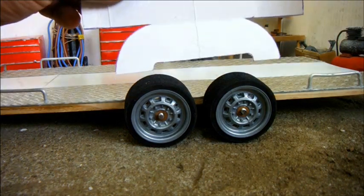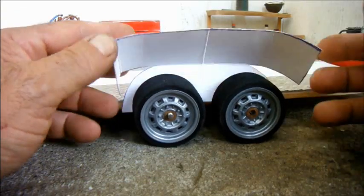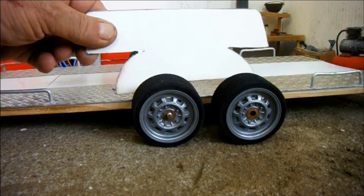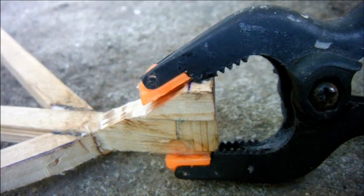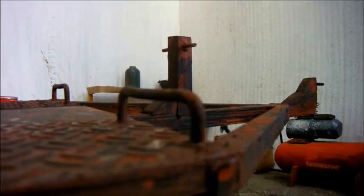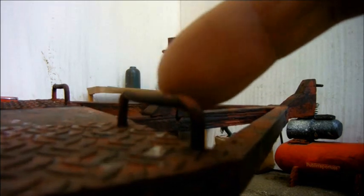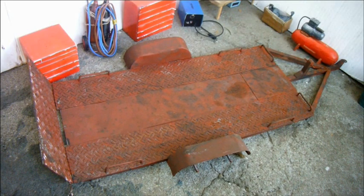so I've made myself a cardboard template which sits down over the axle and folds up something like that, and I've cut myself a pair of these parts in steel ready to fold up and bolt on. Here are the mud guards ready to be screwed into position, and here you can see that I'm bringing the tow hitch up to the right height for my blue six-wheel drive 1950s truck. Also, I've installed this post, the idea of which is that it will rail the truck forward onto these things, and we have an aluminium checker plate access ramp which can be hooked in the up position via this little hook and chain.